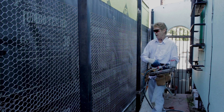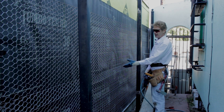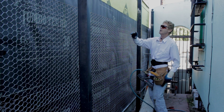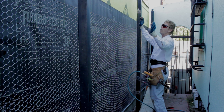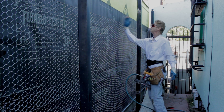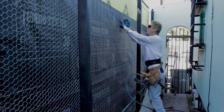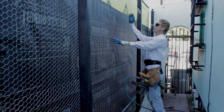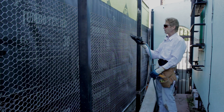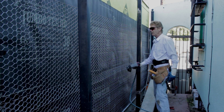On a horizontal, you want three inches — or you could say three squares. Three squares is basically three inches, almost four. On a vertical overlap, if you stopped the wire at one point and started from the other side, you'd go to the next stud — not just the touching stud — similar to sheetrock. You always want to be on a stud to avoid cracking. All our studs are marked, and we use a yellow crimp every six inches.